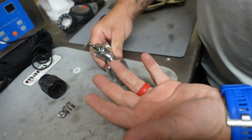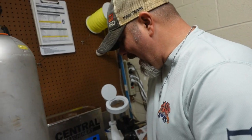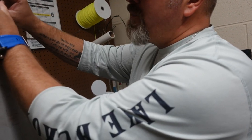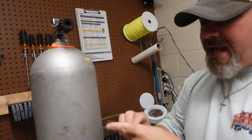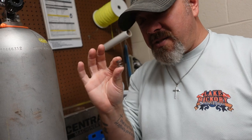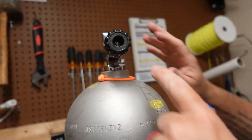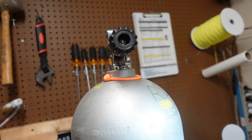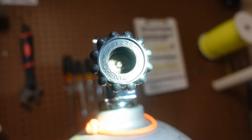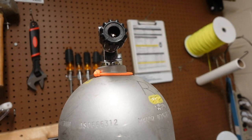The valve post here can be easily damaged if you're not careful, say during an inspection process. So what is actually wrong with this customer's valve? I suspect it's missing the spacer, which means the turn wheel is all the way up against the valve body, and either the spring inside is damaged or it's the wrong size spring. If you also notice, that center post is kind of protruding out, which is an indicator that someone has tampered with this.